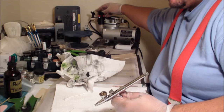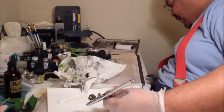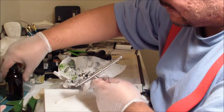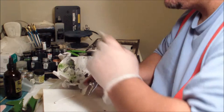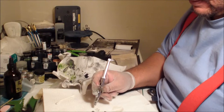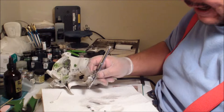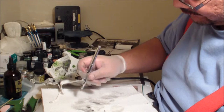Something you'll probably only do when you clean your nozzle: turn up the air pressure considerably, almost to the max. I want this air compressor to really put some oomph behind the nozzle and push things out. What I'm putting in here is essentially Windex — regular glass cleaner — which works really well at cleaning the air gun. As you can see, I still have remnants of the black paint, but running Windex through at high pressure, that black paint is dissipating.